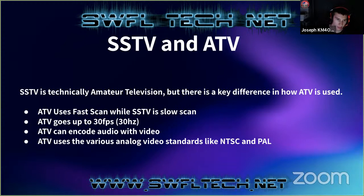It goes up to about 30 frames per second, or 30 hertz, whereas SSTV just goes over the airwaves and takes about 60 seconds to fill in the picture. They encode audio with the video. A lot of the time it'll have a little carrier on the side where they send the high definition audio. And it uses different analog video standards like NTSC and PAL. So it's not digital DRM or anything like that, like when a television station transmits it. This is actually just the NTSC signal.